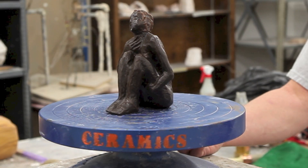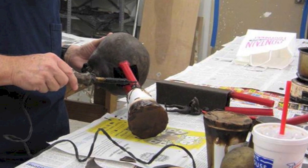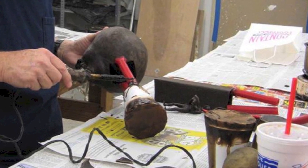The next step is to cast a wax model of the original sculpture by melting modeling wax into the mold. Once the wax has dried, you can sprue the wax sculpture by welding a cup, wax vents, and gates onto the wax mold using a soldering iron.